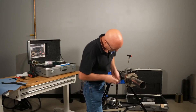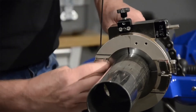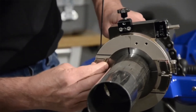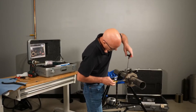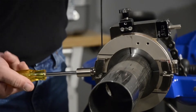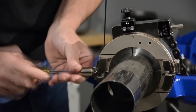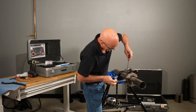Go back and forth to the sides. You want the tool block so it doesn't rack back and forth but so it's not overly tight — just touching that off. Run it down all the way to the bottom of the slide and make sure it's consistent.